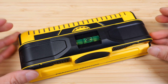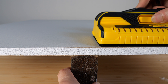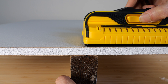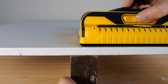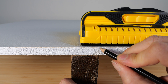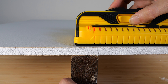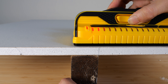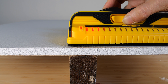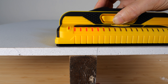Replace the top. I have a piece of sample drywall and a 2x4. Let's move this across the stud slowly. It turns on right there — it says there's a stud. Let's see when the first one turns on there. So I'm going to mark the drywall and we can see how close that is. Pretty dang close for the first edge. As I move slowly across, the second LED turns on a little bit after. Let's see the third one. Fourth. Fifth.